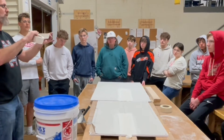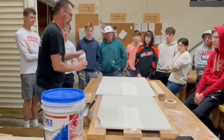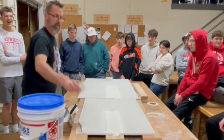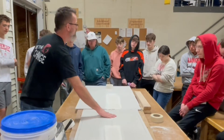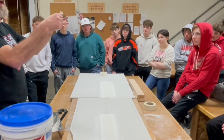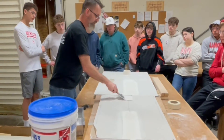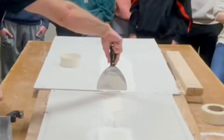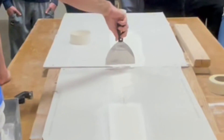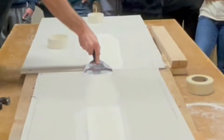If you're doing this professionally, you're using paper tape. There's no adhesive on this — what makes this stick to the wall is mud. So I'm going to measure this out and get it ready, then I'll measure this one out so they're just sitting there ready to go. I've got two different kinds of joints here: this one's got my tapered edge and this one is the butt joint. I need to get enough mud on here to cover the back side of this and cause it to stick. When my knife is straight up and down it's going to be pulling mud off; when it's laying down flat it's going to spread it out. So I get enough of that to cover.